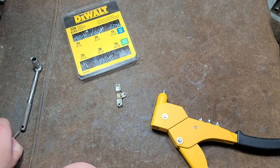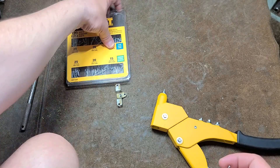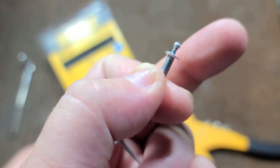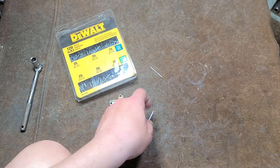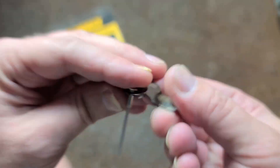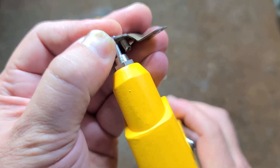There's also a neat little trick for visual appearance. These little collars are held onto the nail by just a small pinch, so you can actually take the collar and put it on backwards. What you end up with is a cleaner-looking result. The caveat is that it's not always convenient because you need access to both sides, and you have to be able to push the rivet through the object and grab onto it with the riveter. It's really important that you have just the right size tip on there, otherwise it will badly jam.